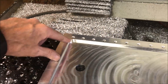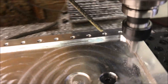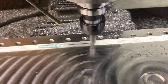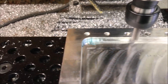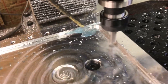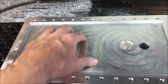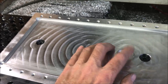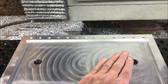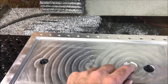Now I'm just going to do a finish pass on the edges and cut out the T's in the corners. I don't think I've ever asked the Tormach to work that hard as it did removing all this material, but there were a couple of mistakes. Looks like the tool was pulling out when I first tried to do this with the three-eighths end mill. It turns out that when I was doing the tapping earlier, I had it in low gear and didn't change it back to high — so it was probably turning too slow, which caused the pullout.